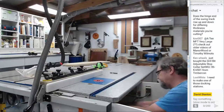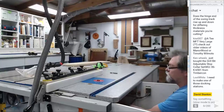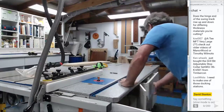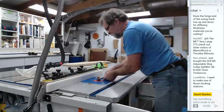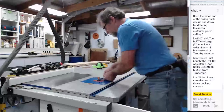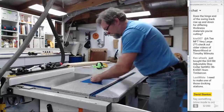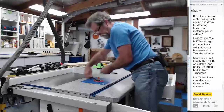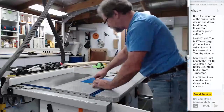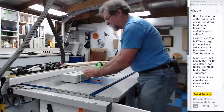And we'll undo this, and I've got to turn the machine off underneath here, which will allow the cutter to come all the way up. And now the spanner. I'll move this out of the way. And there's a double grip on these. There's the second one. I have to crack it the second time. That's a safety feature. I need to take that off and put the half inch chuck in. Collet, whatever you want to call it.